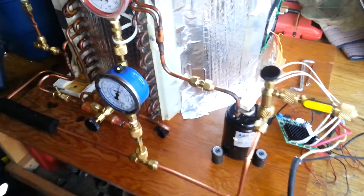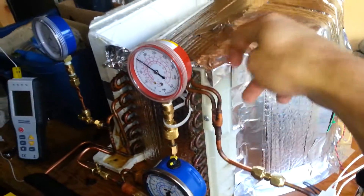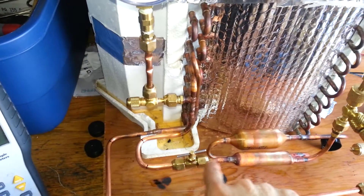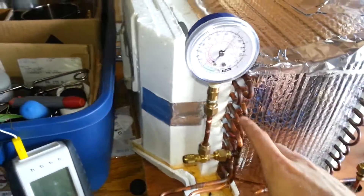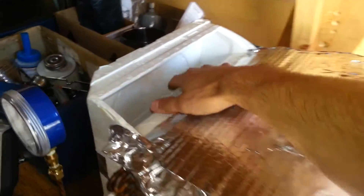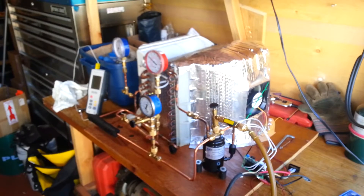If you've watched this many of the videos, you probably have a pretty good idea how this thing works, but I'm just going to review it one more time before I retire it. We've got an 80-watt DC compressor with flare fittings on both sides. There's the discharge — it discharges into a condenser. The outlet of the condenser goes through a filter and dryer. We have a high side gauge and service valve. Liquid goes to a needle valve, which is restricted, then up into the evaporator — there's a service gauge there. It comes out of the evaporator as a vapor, past another gauge and service port, and back into the compressor. Air intake is here from the old styrofoam evaporator housing — evaporator, dead airspace, condenser, dead airspace, fan discharge. That's pretty much it, and that's the end of this particular experiment.